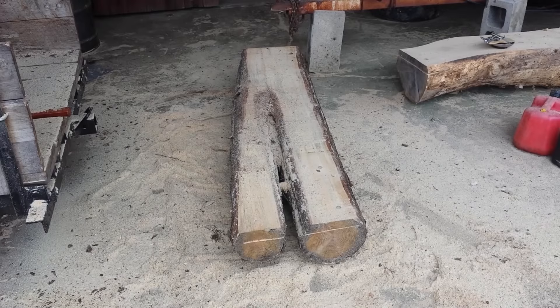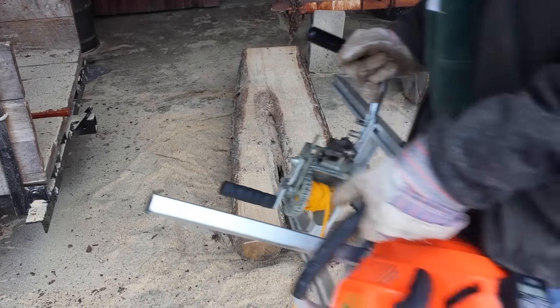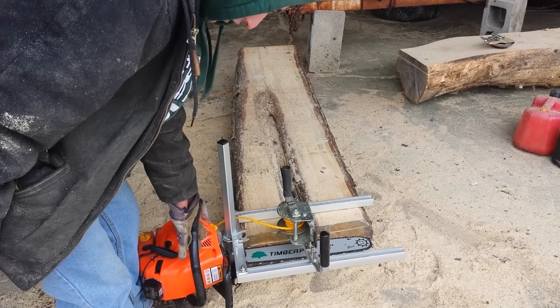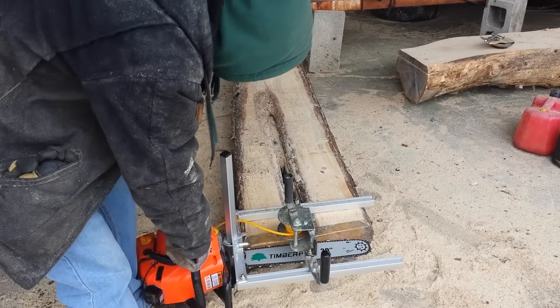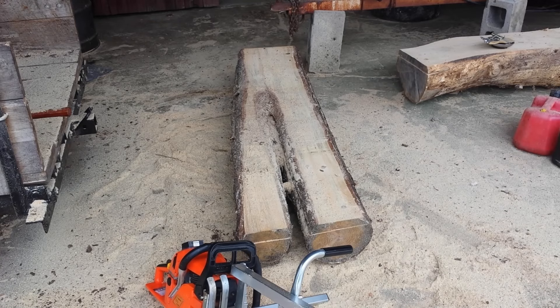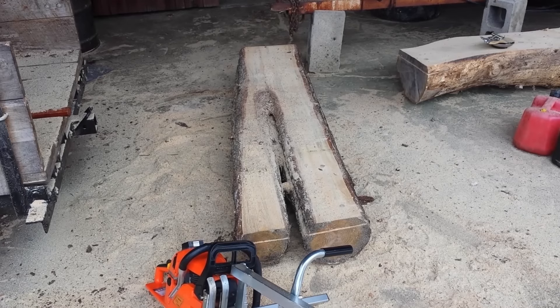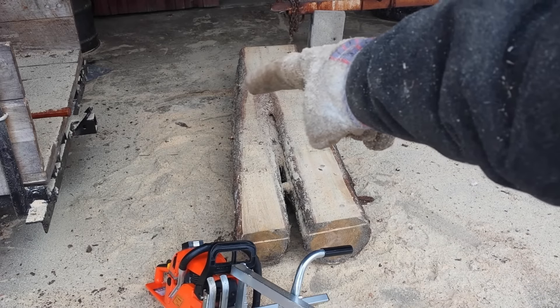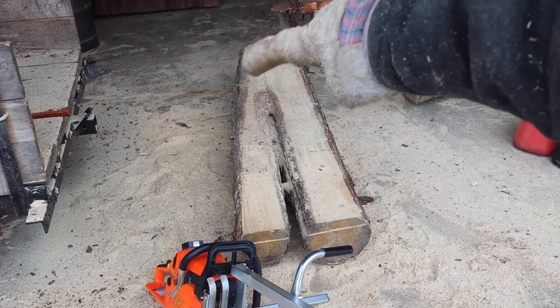As you can see, my bar on my chainsaw is not big enough to go through this entire log, and since I have a single post mill, I can actually just take this thing and go back through the other side. I only have like three or four feet of this side that didn't get cut — it doesn't really matter a whole lot how big the log is, because I can just run back the other side. I also took some pieces of bark and shoved them in so I'm not making the board thinner by cutting what I've already cut, and then I stuck another one just a little bit further down, right at the tip of my finger there.